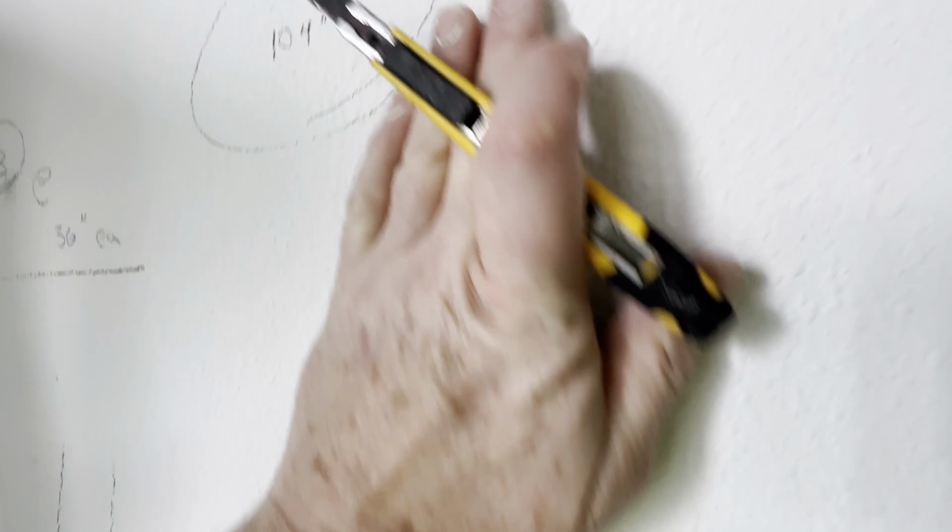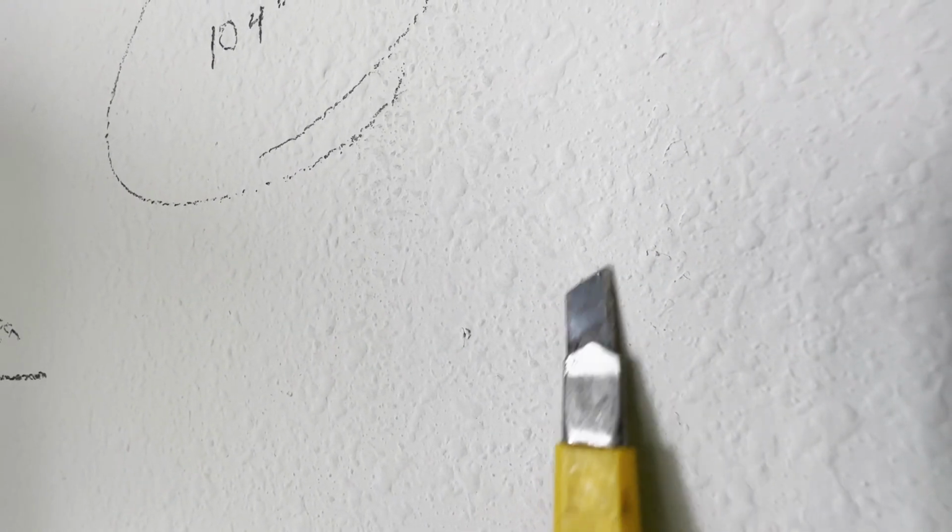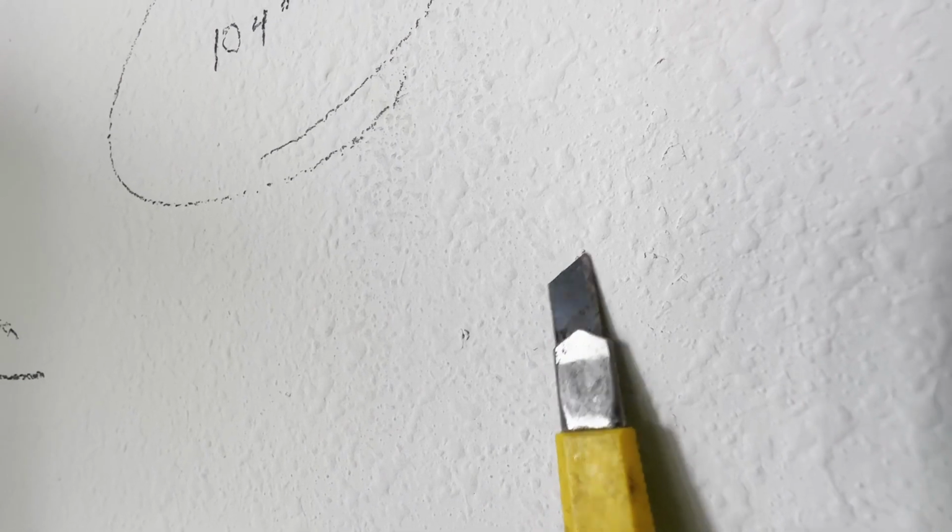Now, if you're working on texture, Grasscloth will cover this without an issue. This is mild. Now, let's discuss sealing it. If you hang wallpaper on this and you don't seal this, you will destroy this. You'll destroy the wall when they take down the wall covering. So, I highly recommend that you seal the pores.